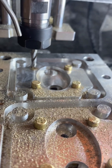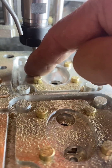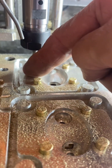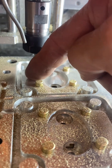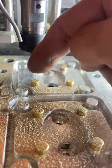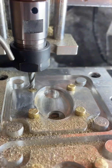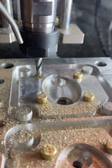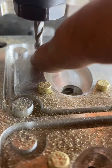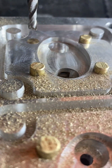So I was thinking there's got to be a way to use the automated process built into the CNC mill. Now what I do is set the same height I want right here, hit the Z height in the program so that is my zero height of my mold, then I have a stock height above that which is the height of the pin and I bore down to that. I just finished the process here — you can barely feel the height difference, but it's done and it's nice.